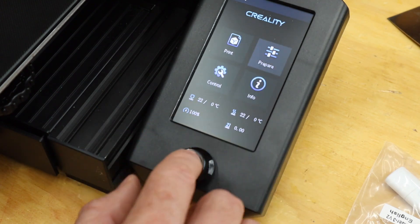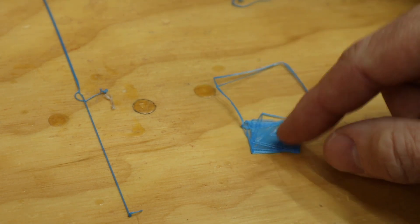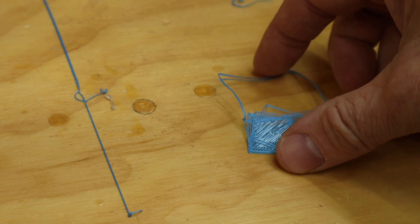I need to spend some more time in the manual. With the build done, the next step is to try it out — you can actually hear it running right now. I watched a couple of videos and read some documentation, then went on Thingiverse and got the calibration cube — a little 20mm by 20mm cube with X, Y, and Z on the faces. I loaded it into the Cura slicer software and went with the defaults. It didn't work: it printed a skirt around the outside that was already starting to move, and then when it moved to the middle to lay down the base, things were off, so I aborted it.